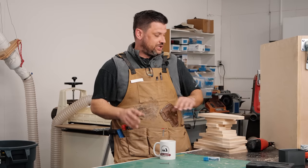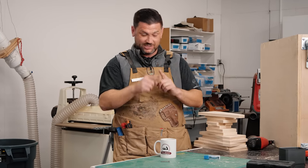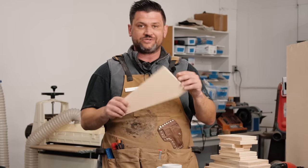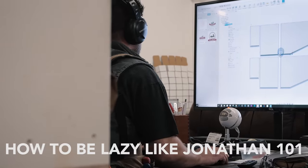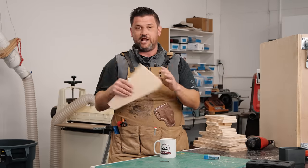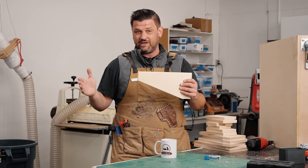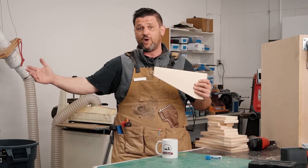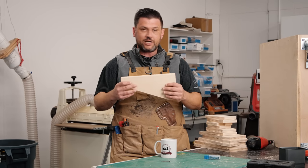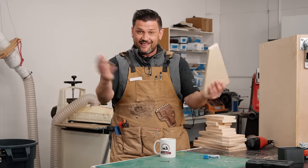Now that we have the door on and adjusted, we're just about done. We're going to put a handle on the door and engrave it with a new tool I just got. We're also going to put on the wings — basically a six-inch wide by twelve-inch box cut at an angle to give it some support. I'm putting small wings because most of the time I'll just need those; if I'm doing big lumber for crosscuts, I'll need a support system eight feet away anyway, so there's no point making a giant wing that would sag under a large board. I've got a big shop, so they won't need to fold down — they'll be more rigid that way.